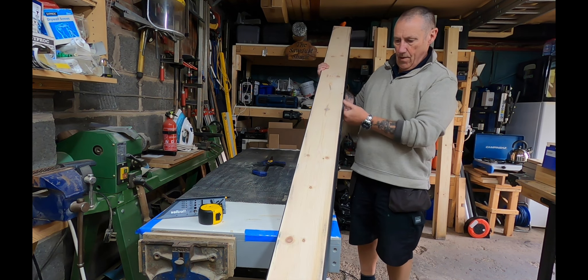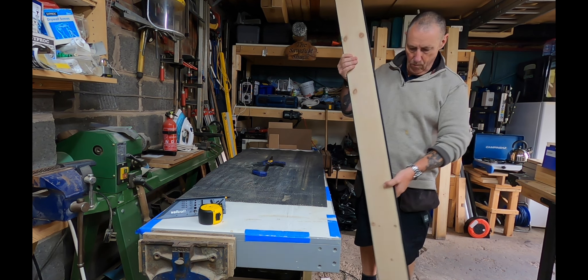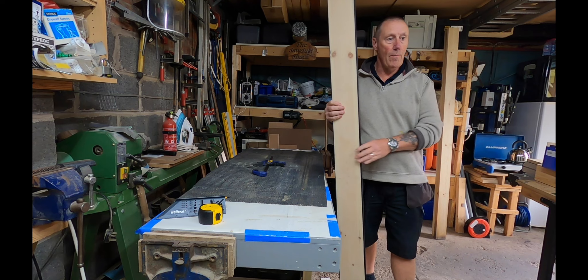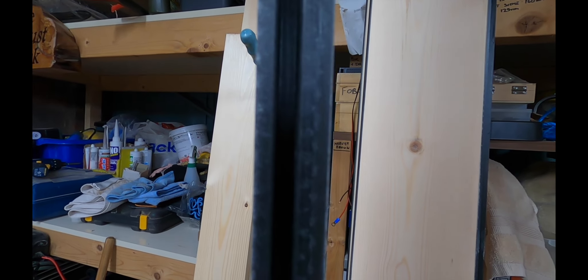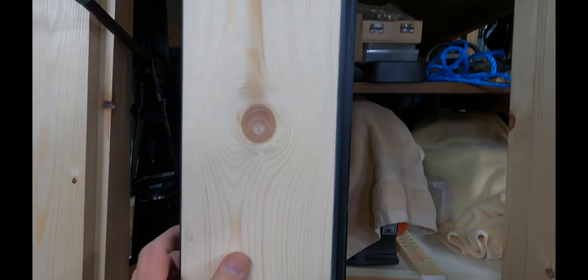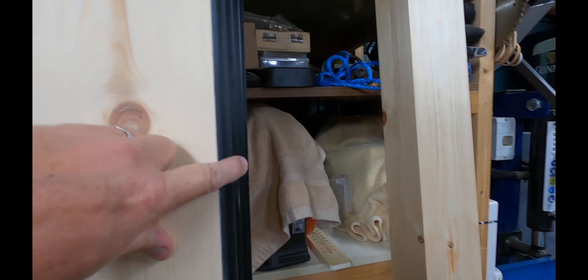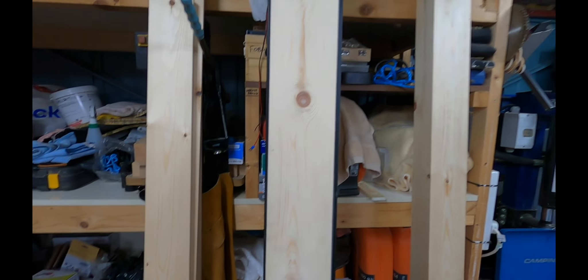We've got that off — just leaving our edges painted so they're protected. It won't interfere with our top coat when we give it the final coat. Got all eight of them sanded up now. As you can see the front face is nice and clean and the tongue and groove have got plenty of paint in them. So now if there is any expansion when it's all together, or any movement, or even if water gets down in between, it's protected — whereas on a gate you buy you can't get to them to paint them, and that's where you get your white lines from.